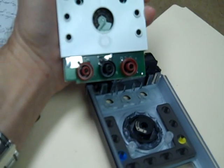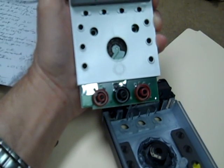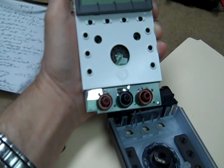It only has three input jacks. One is a 10 amp input; the other is for volts, ohms, capacitance, etc. The 10 amp jack is also used for microamps — I'm not exactly sure how they accomplish that. Regarding the LCD, while LCDs are usually critical as to viewing angle, this is much more so when the backlight is on. If it's tilted, you virtually lose sight of the digits altogether. Looking straight on, the contrast is excellent, but looking down from above you won't see anything. By the way, it uses six conventional LEDs for backlighting, and the current drain with the backlight on is about 150 milliamps.